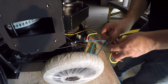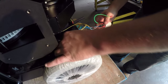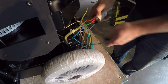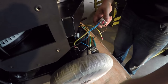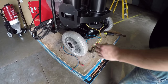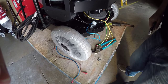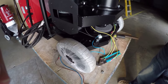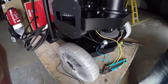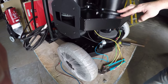If need be, we have wiring diagrams on our website that will show you how to correctly wire the soft start and the electronical filter back together. If not, we can always take photos before we go disconnecting any wires. The easiest way to remove the soft start when you're in the field is to simply cut off the soft start. You will later adjust the sizes of the wires to accommodate the lengths you need and splice them back together. We have now removed the electronical filter and the soft start — quick and easy without having to disassemble all the engine tubes and the engines.